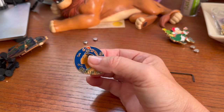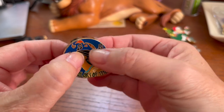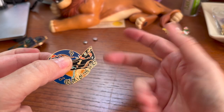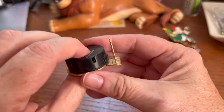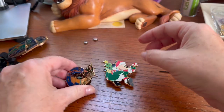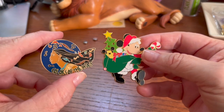That's how easy it is to change out the batteries. I know it says batteries are not meant to be changed — they probably thought the batteries would last a couple of years, which is good enough. But when you collect pins and you're disappointed they're not working, we're here to fix them up and show you how. We now have both of these working — the sound and the lights. I hope that video was helpful in helping you restore your sound and light-up pins. Let us know in the comments if you've tried this and how it goes.